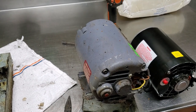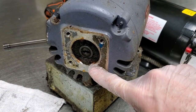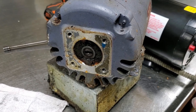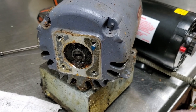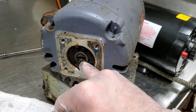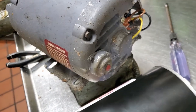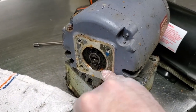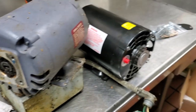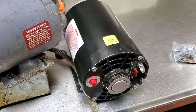Generally speaking it frees up on the first try. Then go back and rewire it, start it back up, and it should be good. The reason I'm replacing this motor is that the pump that bolts onto it leaks - they all leak there, there's nothing to prevent it - and oil built up beside this motor and made its way into the motor. When I disconnected the pump from the motor and turned the power on, it would only spin very slowly, drawing high amperage, and then it would trip the reset button in the back. You'd reset it and it would start all over again, running for a few seconds before tripping again.